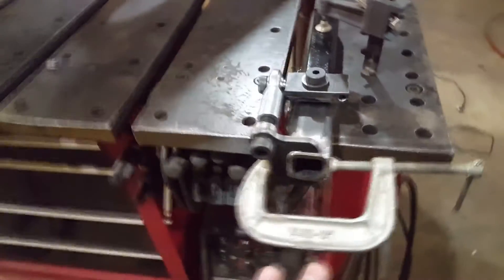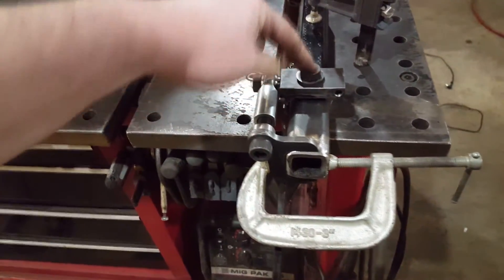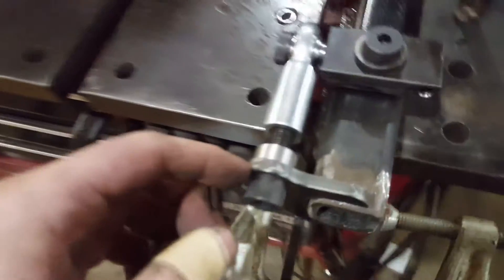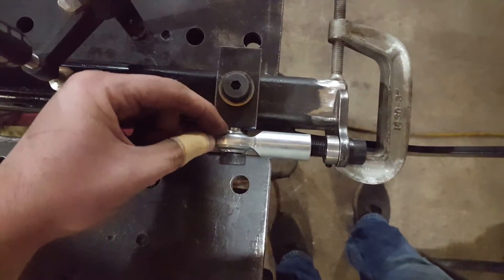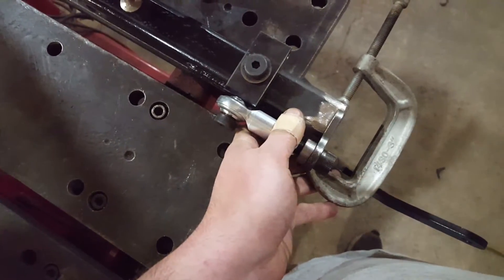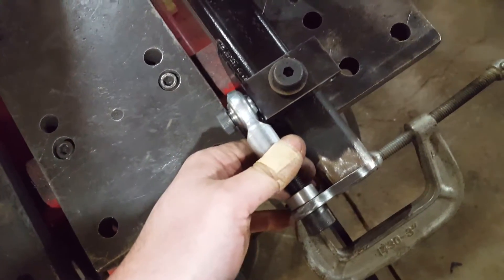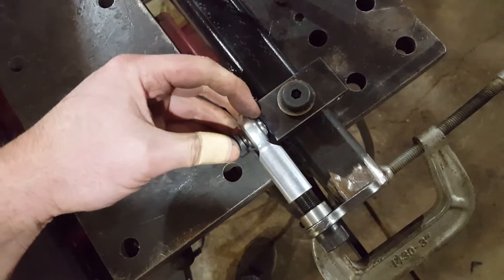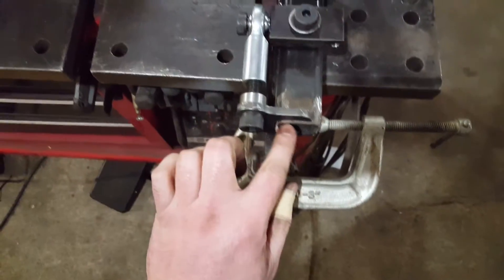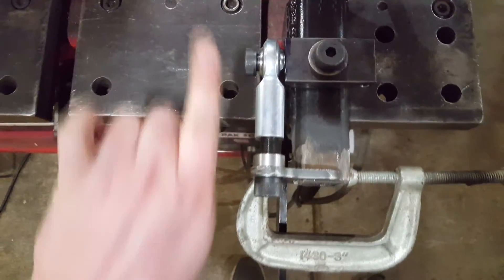When you go to weld this up, here is the process I suggest. Mount this on your tension arm, attach the rod end, and attach this piece. The goal is to have a little bit of gap on both sides of the shoulder bolt. You can do that when you clamp it by pushing it into position — try to keep it centered on the shoulder bolt. In a perfect world you'd have even gap on both sides, but if it's not perfect, it's going to be okay. The orientation should fit well, but if it is a little loose, the goal is that this face is parallel here.